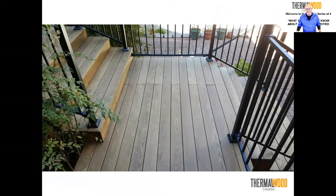You can have the decking coated — if you don't coat it, remember this is thermally modified wood, so the inherent oils that would slow graying have been removed, causing the wood to go gray very quickly. A deck installed in the sun in the summertime could go gray in just two to two-and-a-half months. To keep that color, you need UV protection. For decking especially, use an oil-based product that soaks into the wood — we use Q-Tech, a synthetic oil-based product developed in New Zealand that soaks into the wood with pigments sitting on top.